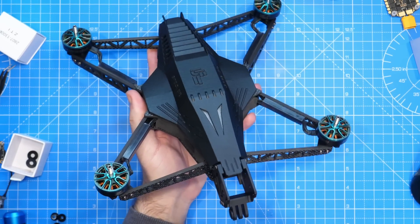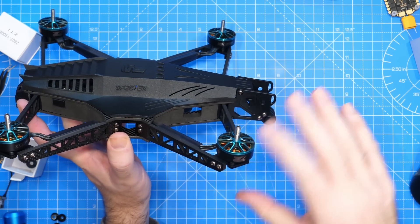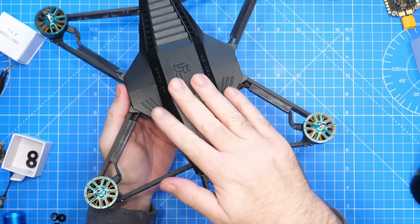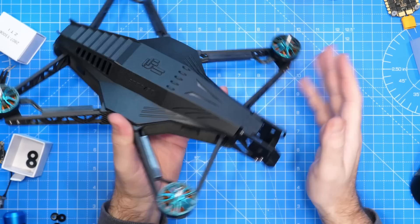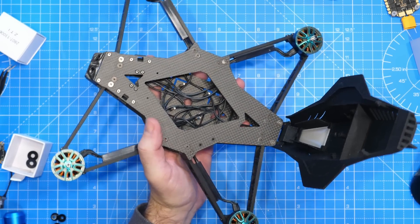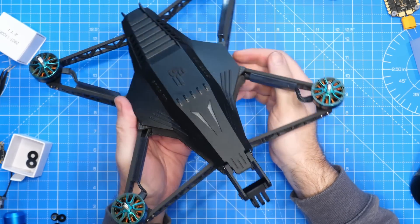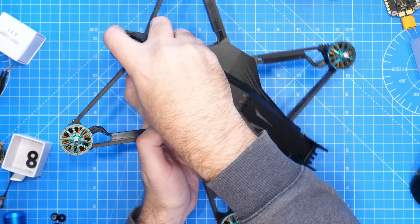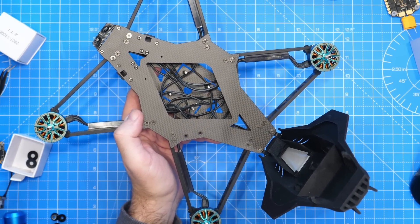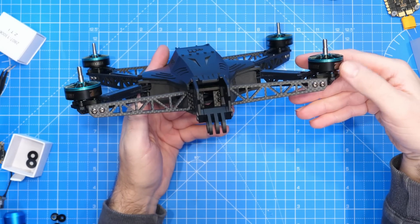For the final part of this video I wanted to show the build with the motors. I'm going to be using these ZT Innovate motors they sent me — I'm in the process of testing these. I've gone with the 2807s, 1300kV, which is similar in size to what iFlight are doing on the bind and fly version. I was looking at something a little bit bigger but I think it'll probably overdo it. I've got to do all the electronics in part two. I haven't built a 7-inch for quite a long time so I'll turn this into a bit of a series over winter. I'm not sure what flight stack I'll use yet — it'll probably be AM32 and a Skystar stack that I haven't used yet.